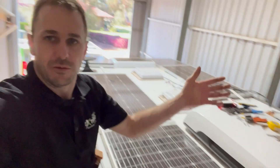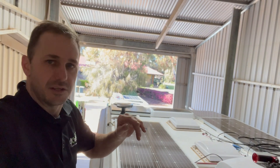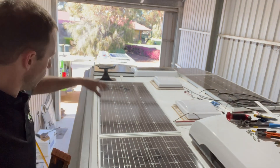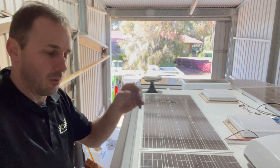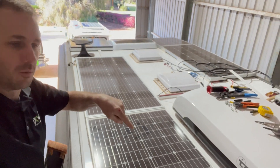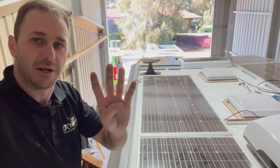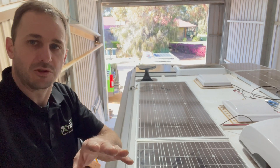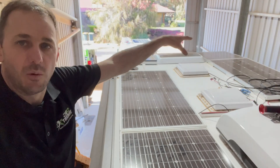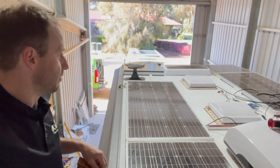So we have to redo it and we're gonna make it better. There's 760 watts of panels up on the roof here with a couple of shading issues. We're adding another 300 to this, but what we're gonna do is split the system in three — running three solar controllers networked on this. The 400 watt array: one is over there, one is here, and the other two are up the front. So four Enerdrive 100s on one solar controller, those two 180s on another, and our new 300 watt system in front on a third. All three networked together for a combined charge.